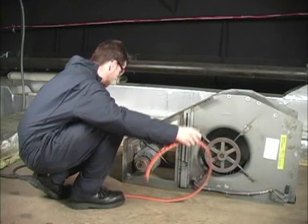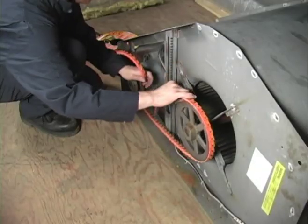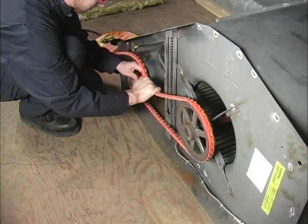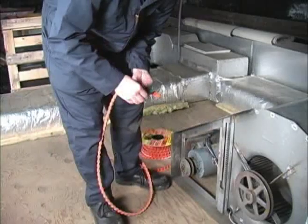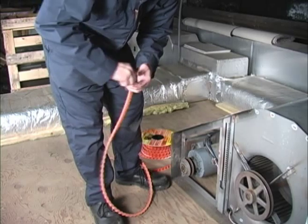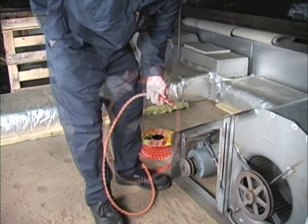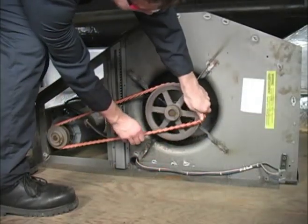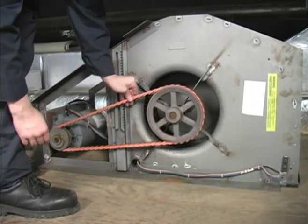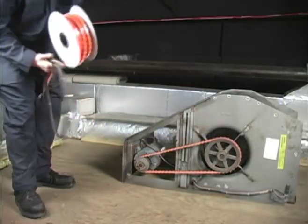And with New T-Link or Super T-Link, it's still a clean and simple installation with minimal downtime. Position the belt around the pulleys to determine the required length. Remove the necessary number of links to achieve the proper tension. Make the belt endless and roll it onto the drive, starting with the smaller pulley. The tension should be checked after 24 hours of use, and periodically after that.